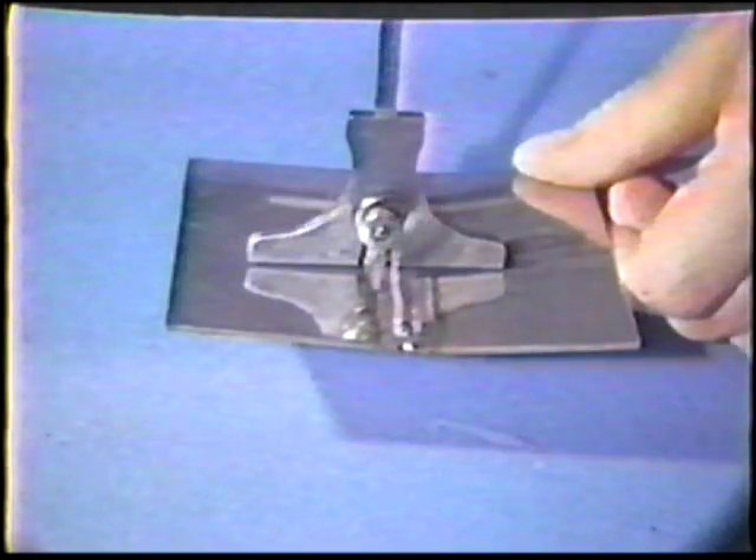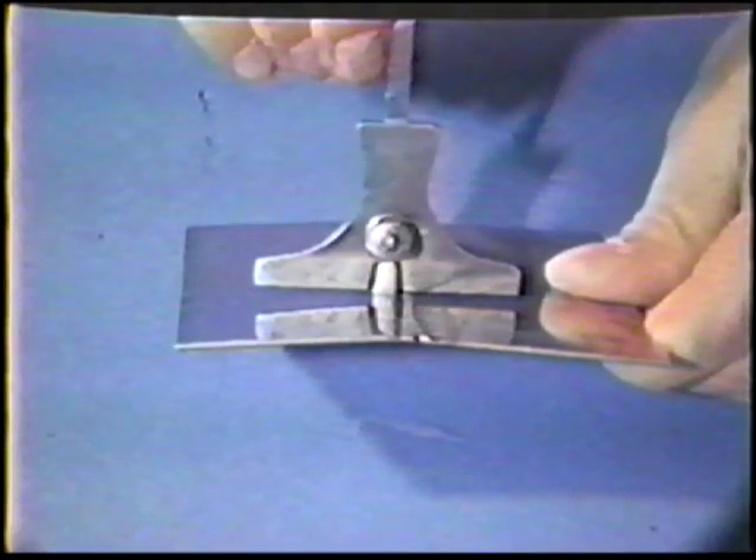There shall be no porosity exceeding 1/16th-inch maximum, and no more than a combined total of 1/8-inch of porosity in any 1 square inch of weld. The face reinforcement shall be a minimum of flush with the base metal to a maximum of 1/16th-inch. The root reinforcement shall be a minimum of flush with the base metal to a maximum of 1/16th-inch. Reinforcements for both the face and the root must blend smoothly into the plates, with transition areas free from edge weld undercut.